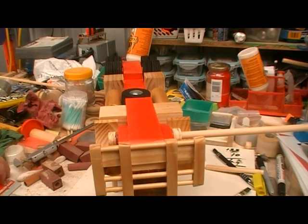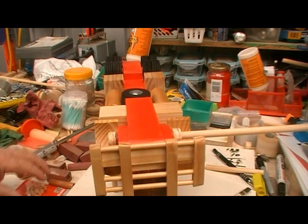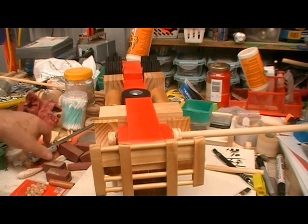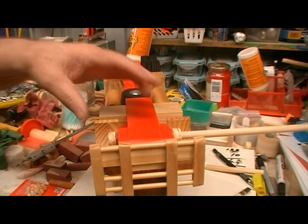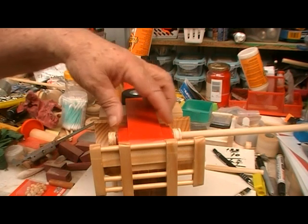Just stepping back a bit to a truck here. When I'm doing the axles for the trucks and trailers, Aschi gives you the length in his plans, but because sometimes wood will have up to 1 millimetre difference in thickness, I prefer to measure mine. What I do is I put all the settings on it. I've got a fibre washer, a wheel spacer on each side.